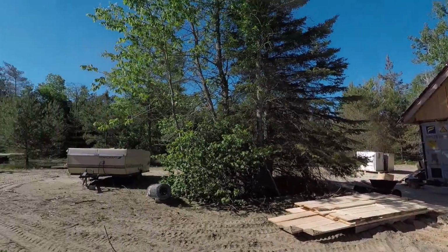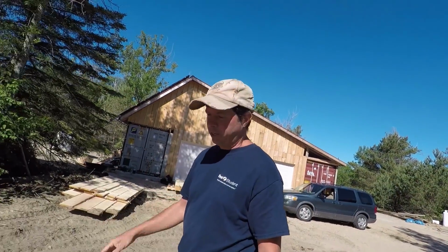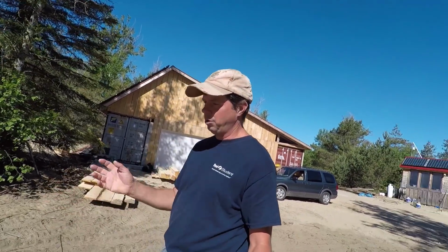We kind of have them strategically placed at different places on the property, so I can work on them in some places. Like we have 4 of them up at the house that don't actually require any joinery. They go into the basement, and they're just fastened there with some mechanical fasteners, because they're just there to carry the load from the timber frame up above down into the basement.